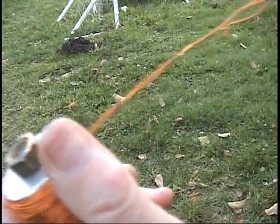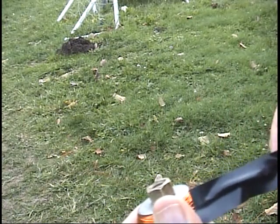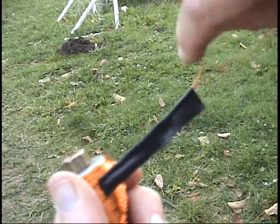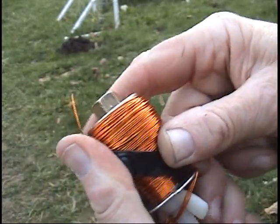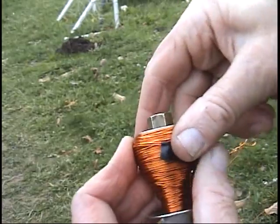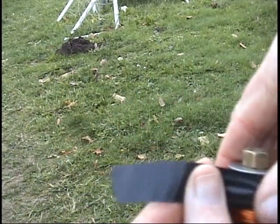When you get to this stage, you leave maybe five inches of wire here. I've put some tape on my hand — there's a reason for this. This wire is going to fold over. I've covered both wires — these two wires that come out are going to come down here like this, go like that, and come out at the bottom. I'm going to be winding that long length of wire over all of these, so I don't want it to chafe and ruin the varnish when I put the next layer. I have another piece of tape — you better get this covered because you don't want it to unwind on you.